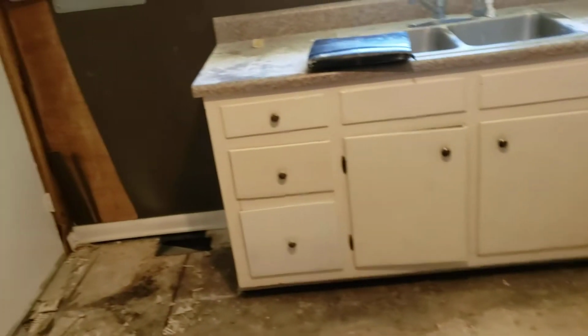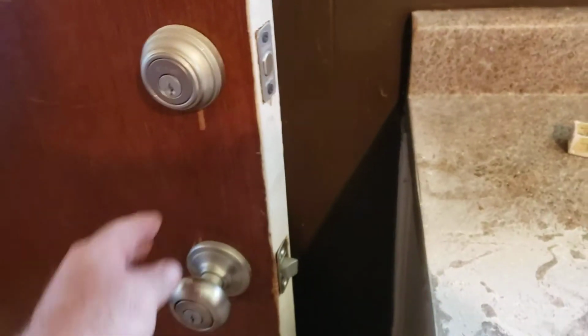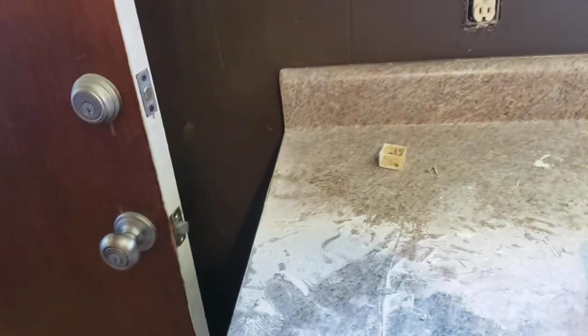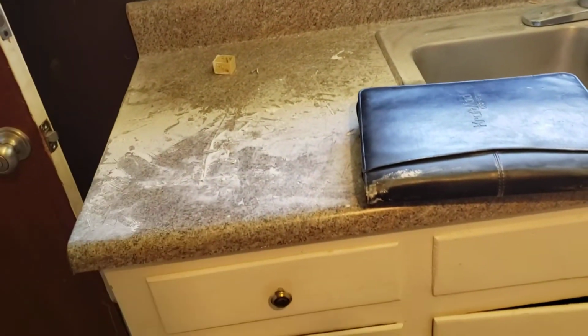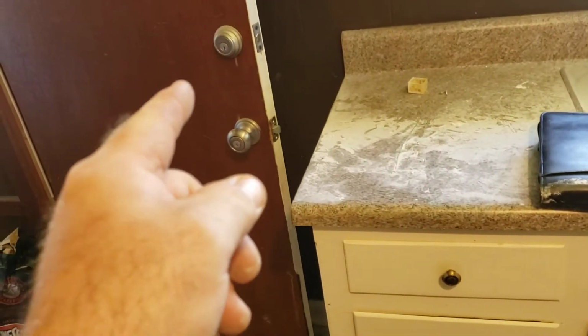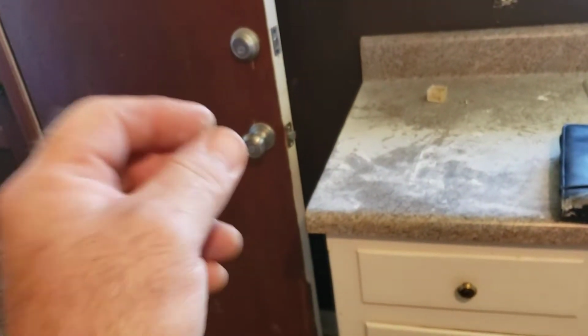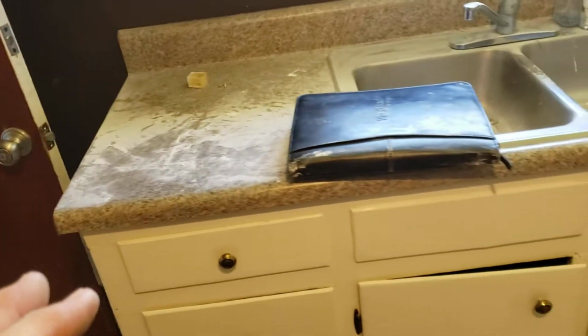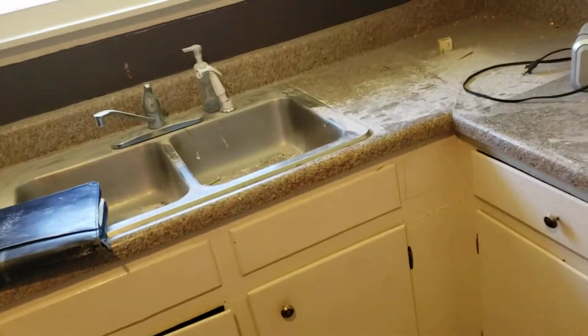Now, in this particular kitchen, there is a back door. Take a look right here. When the back door is open, it's within about 4.5 inches or so of the end of this. So with your design, with a sink base 30, a dishwasher 24, and a 2-inch filler, we are just fine on it not touching the door. It comes within 1/4 inch of the end of that striker. So as far as that goes, your design works fine on the baseline for the corner being a void.